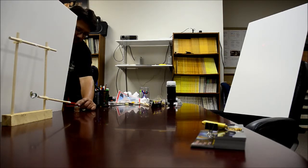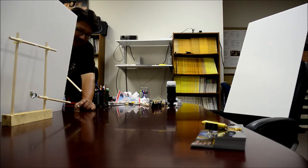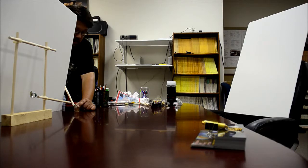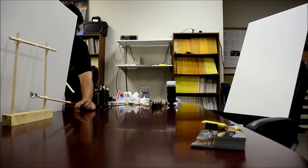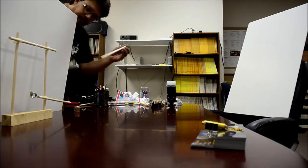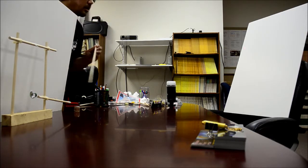I'm going to hold this in place because this tends to grab a little bit. You can see even my little movement here has altered this. I'm going to bring in the magnet slowly — and you see there's a movement. And we'll try and take it away quickly — see there's bigger movement. You can see there's a current being induced in this second green coil here, which is creating a magnetic field that affects the permanent magnet on the back of the mirror, changing its position.